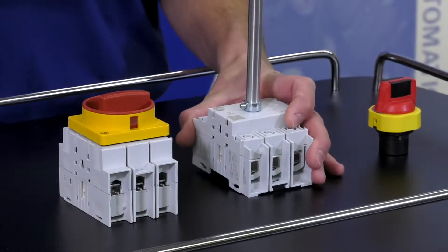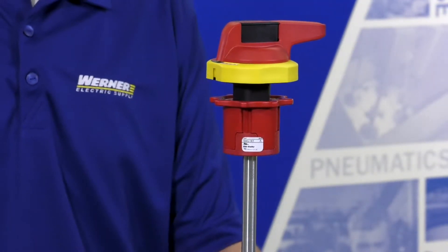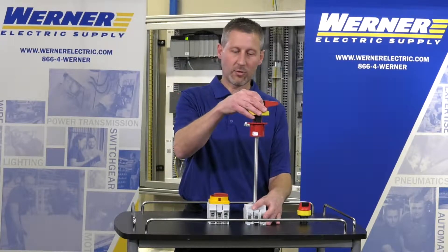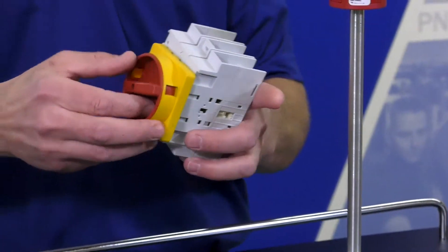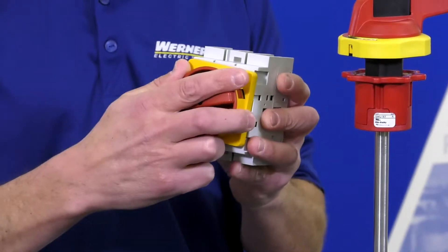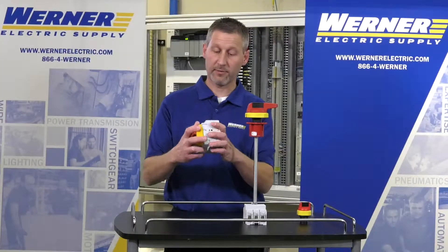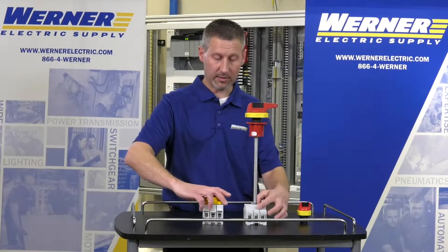As you can see here, you have styles that can be used with a shaft, so it's going to be mounted to the back panel on DIN rail or panel mounted through the door, with the disconnect handle mounted out on the door. You also have a style that can be front mounted — mounted on the inside of the door — with the handle and the whole switch mounted right to the door. That would be a front-mounted option with the screw terminals, connections, and labeling on the back side versus on the front.